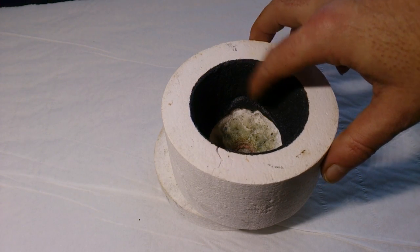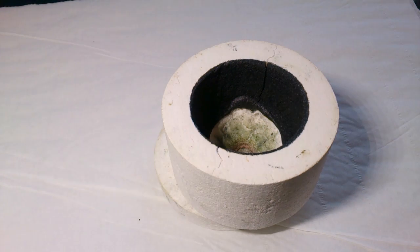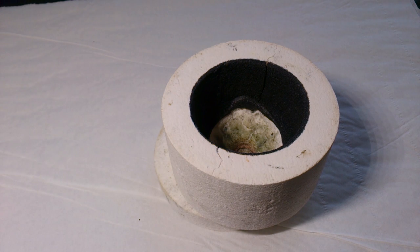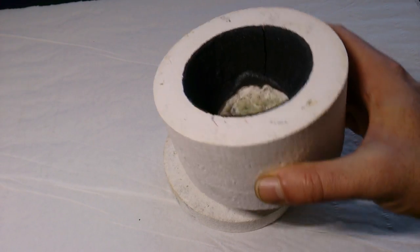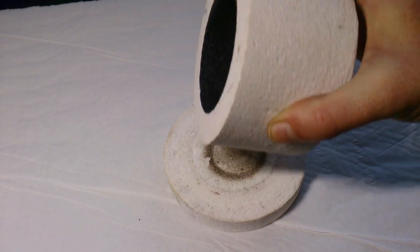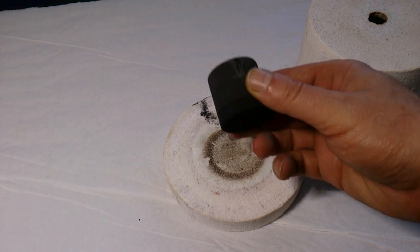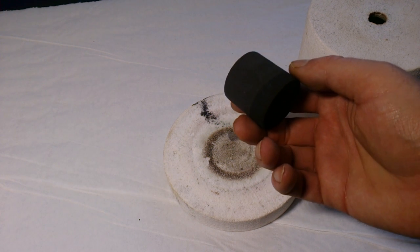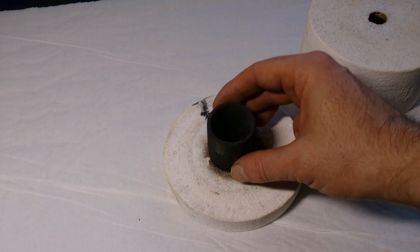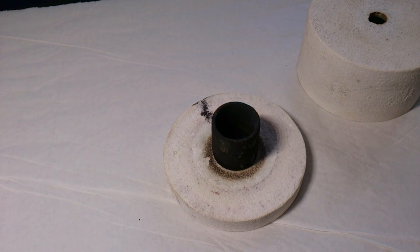It's time to show you the trick. The black coating is something that generates heat, but this kind of heat may be enough for fusing glass — not for melting gold. So all you need is a graphite crucible. It has to be a graphite crucible. Graphite is something that generates serious heat while consuming microwaves. Just get yourself the smallest and cheapest graphite crucible, put it inside the furnace, and it will do the job.